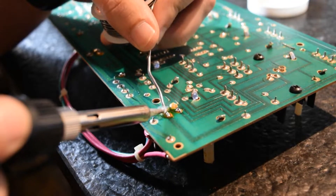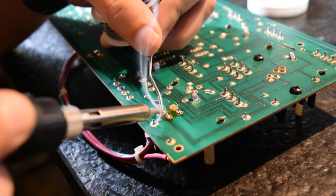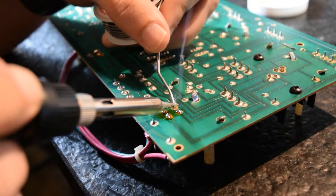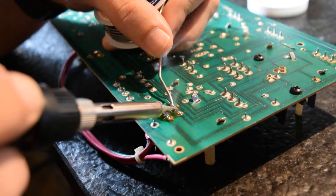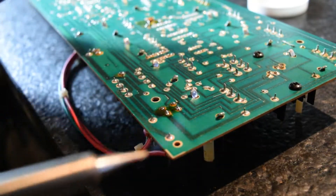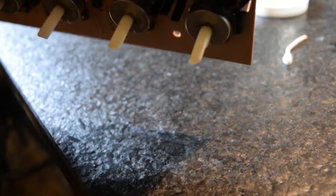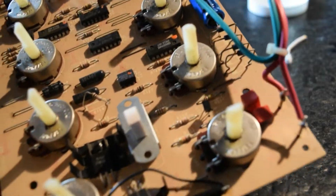A good reason for being gentle with this board is it's one of the first generations — it was actually made in 1979, serial number 1179, so it should make it the 79th Prodigy ever made. We can flip the board over and get a look at our new caps — they're smushed in, but it's a lot better for the board.